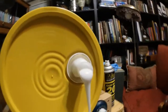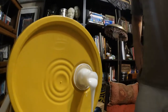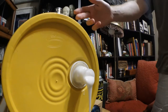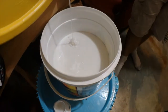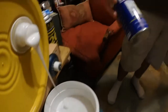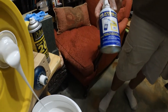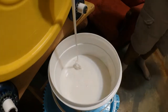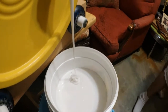I don't have any supplied air or anything. I usually take an air chuck and put it in here and just pressurize it to get a little bit more out. I don't like to open up the tops because that ends up introducing more oxygen to the canister and shortens the shelf life and dries it out. Once I close this back up, we use Smooth-On's Extend-It — it's a nitrogen gas blanket. Put it back in there and it displaces all the oxygen and carbon dioxide so there's no oxidation.